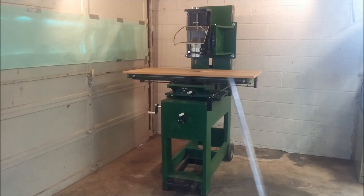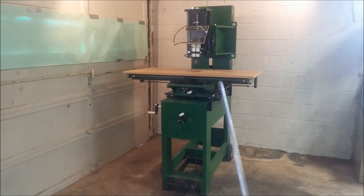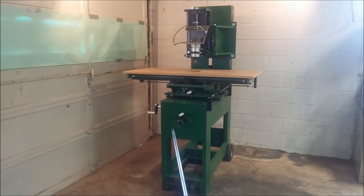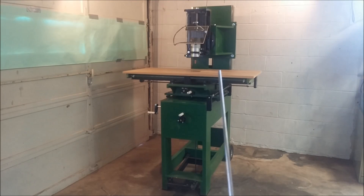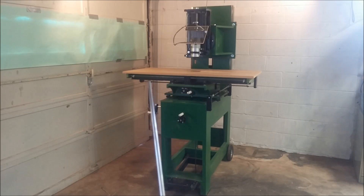This table, because it goes so far to the right and left, cantilevers so far out. I actually have six wheels — three on each side, with one behind this block here — for extra strength when the table is hanging out on either side. One of the other features I created is stop blocks on the table, so that when you're routing and want to come to a certain spot and stop — when I first built my original ones, I just used lines, and sometimes you made it to that line, sometimes you went a little farther.